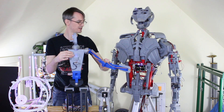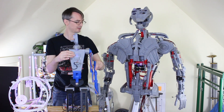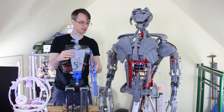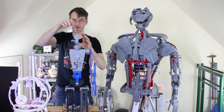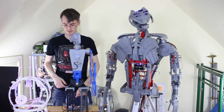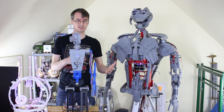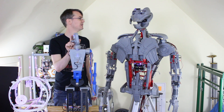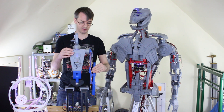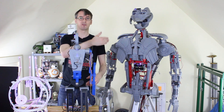We should be able to spin the arm a little bit as well. I've also implemented a zero switch — if I think it's losing its Z position because of magnetic fields, I can just press it on my controller and it sets everything back to zero. So now this is the new zero — obviously if it's wrong, we need to put that right — but at any point we can zero up all these sensors to make sure they're straight and press zero to put everything back to the middle.